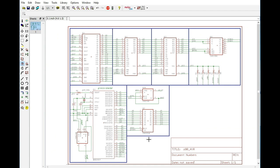Of course, we're going to have to add an SD card circuit, which will be pretty straightforward. Obviously, we need the SD card connector, and then we'll also need a total of, I believe, 6 resistors. That way we can do voltage dividers to bring it from 5 volts down to 3 volts. And then we will also need a voltage regulator to give that circuit 3.3 volts for the SD card. And I think that's pretty much it.